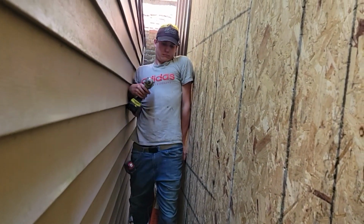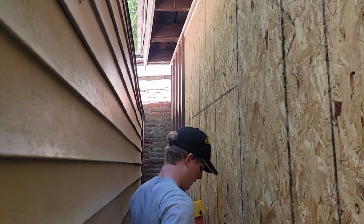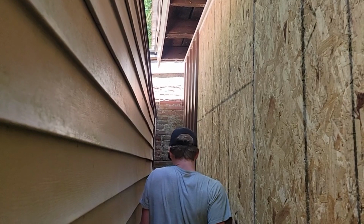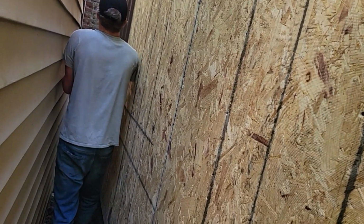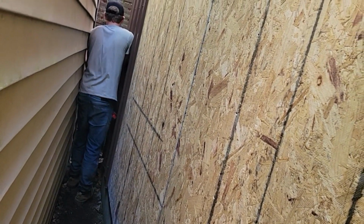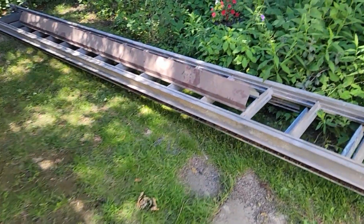Yep. We're going to do the outside corner next so that we're not abusing our metal by banging going by it. And the outside corner is going to be a little longer on the other side. So give me a number. We'll come down 1 inch below the metal with a number. Okay. So it's probably going to be like 97 on this side. And then figure out what the other side you want to cut like. Because these are 10.5 foot sheets.